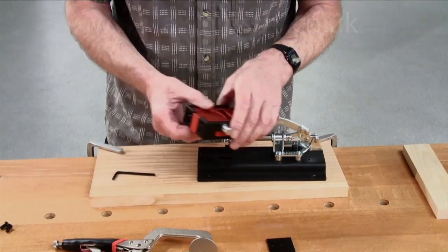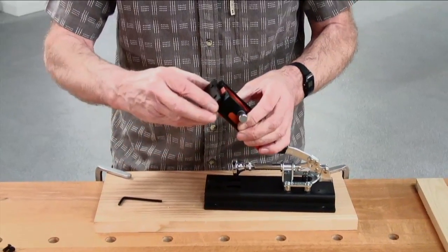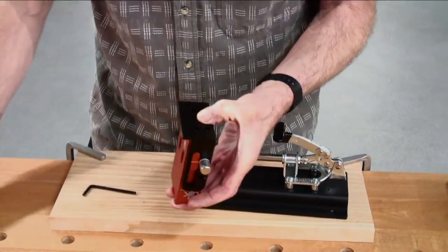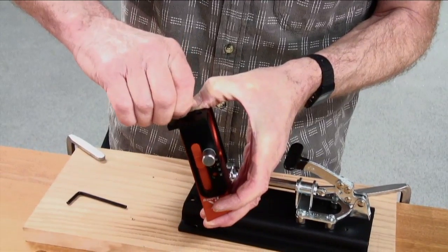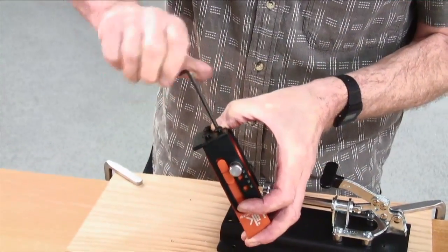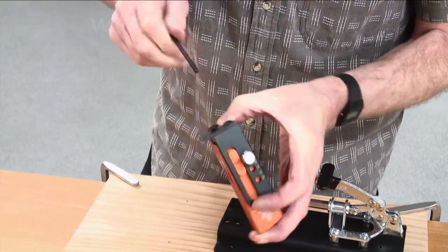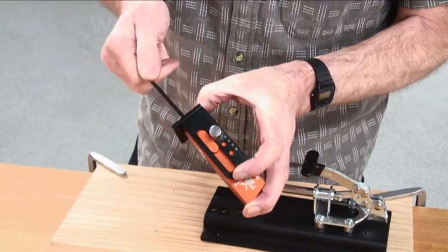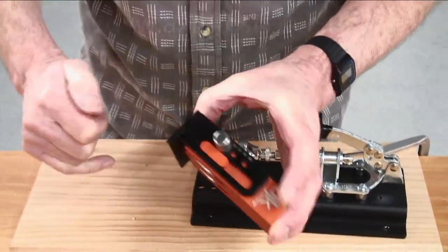Now the portable plate is attached to the end of the drilling block here, and I will do this using the same screws that we used to hold the block in place on the actual jig itself. The same scale settings apply when using the jig in this manner, so the different thicknesses of timber can be accommodated purely by adjusting the scale setting here again.